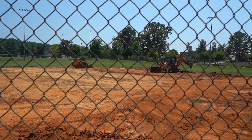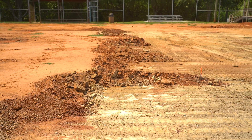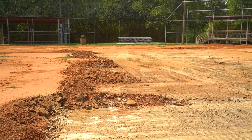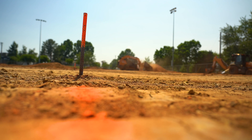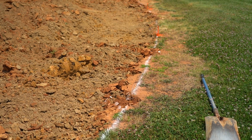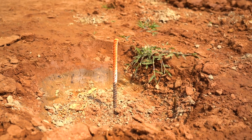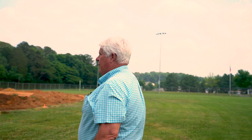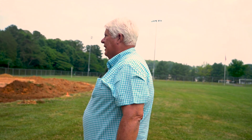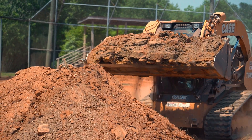As you can see, we've got two pieces of equipment down here — our backhoe and our skid loader. We've laid the field out on a 20-foot grid in each direction with orange-painted markers to give us guidance as we dig out. We want to go from the painted line at the original dirt surface down four inches on each stake and everything in between, and then when we put it back we'll bring it back to that painted line to give us the right elevation.